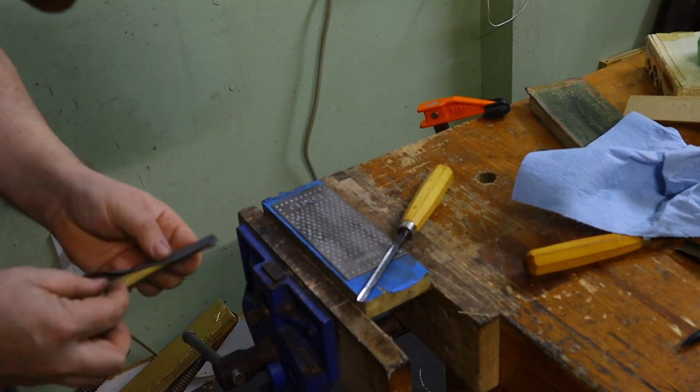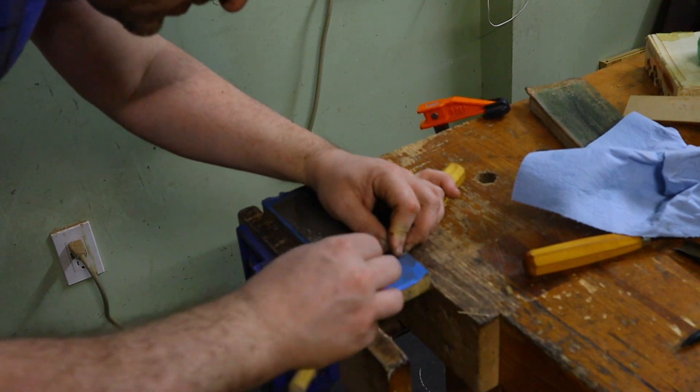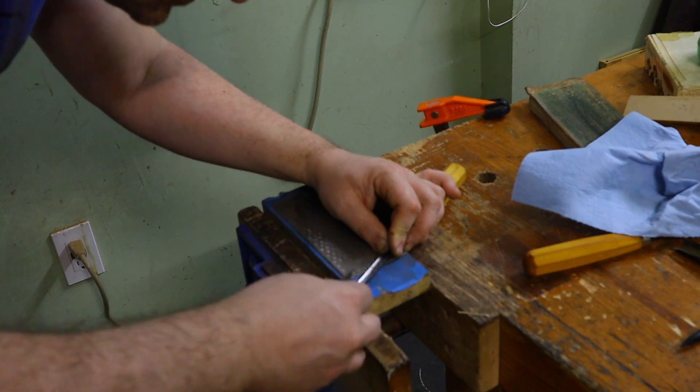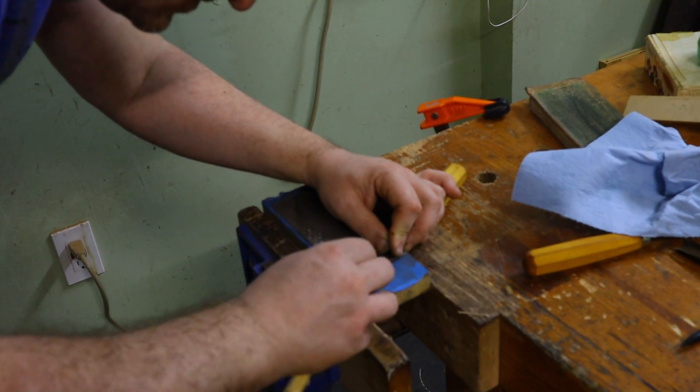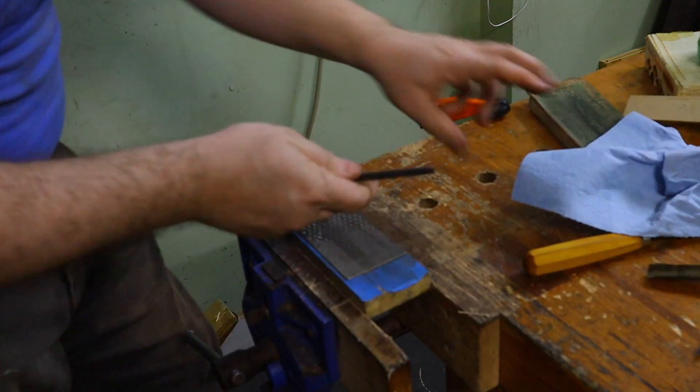Moving forward, I needed to refine the back edge. As I already honed with the 1000 grit sandpaper, I only used 2000 grit to carefully hone and remove all traces of the burr on this side at this stage, and overall polished the edge. This literally takes a few seconds. And then the ultimate stage — stropping.